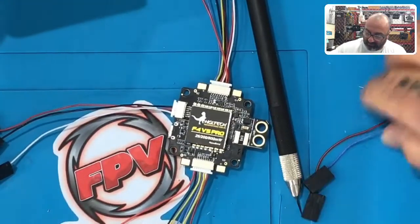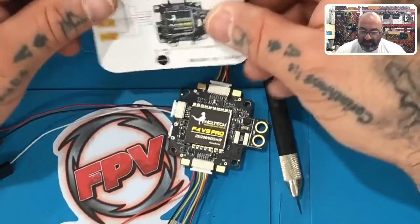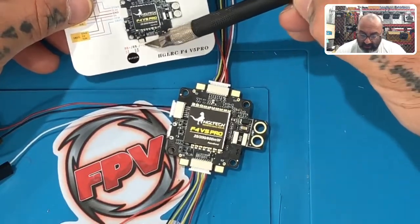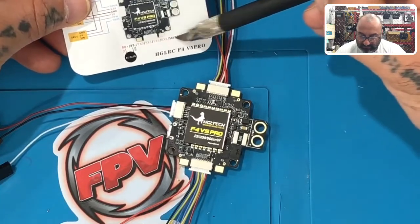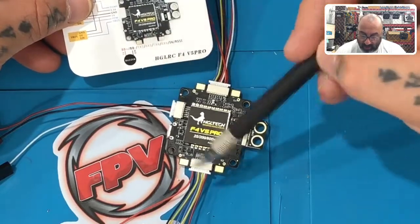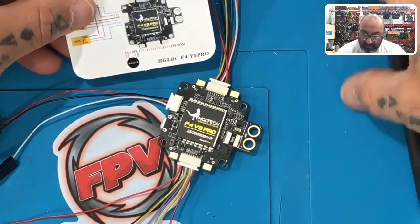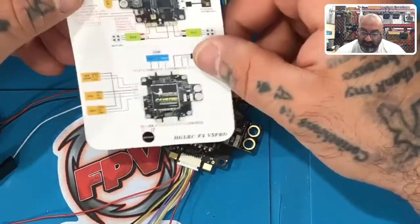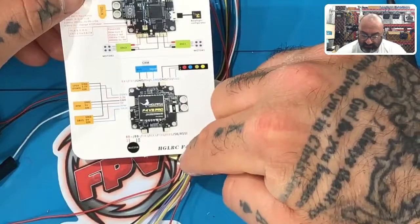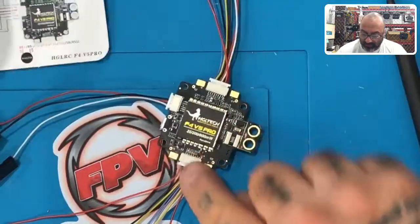Take the removed wires and put them aside - save them in the little box. For the next harness, I'm only going to be using the buzzer cable, which means I'll remove every single wire except red and black. If you're using a TBS and want to install your own TBS, you can use TX3, RX3, TX6, or come over here where RX1 and TX1 are on the top.